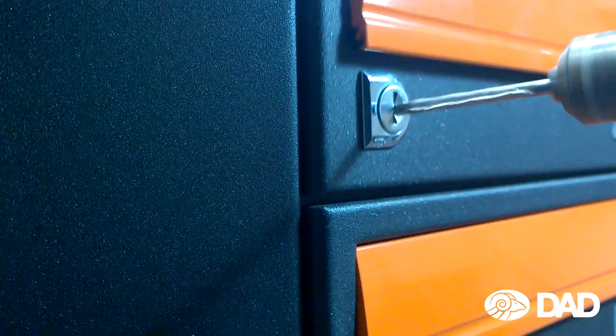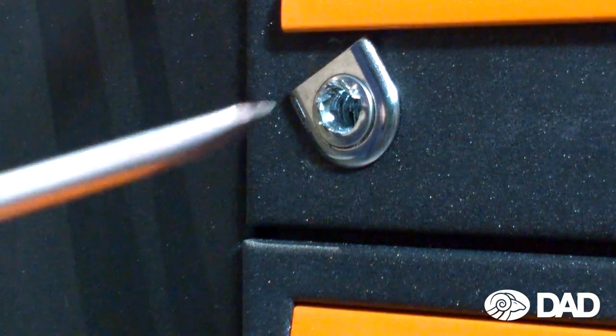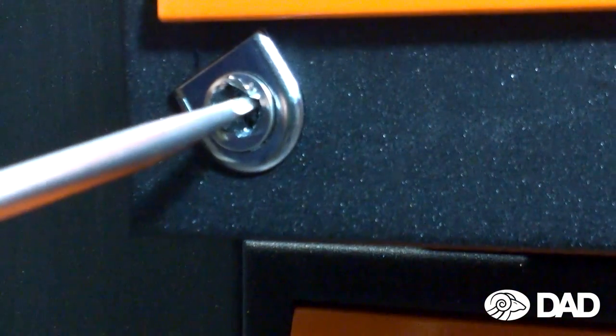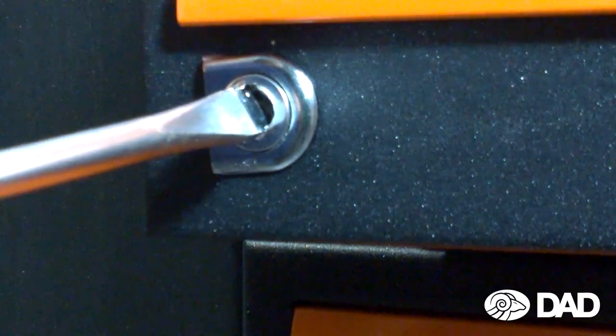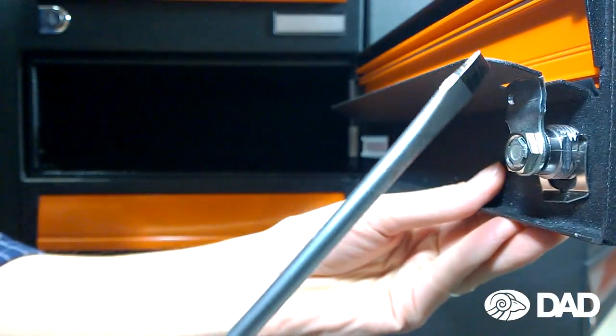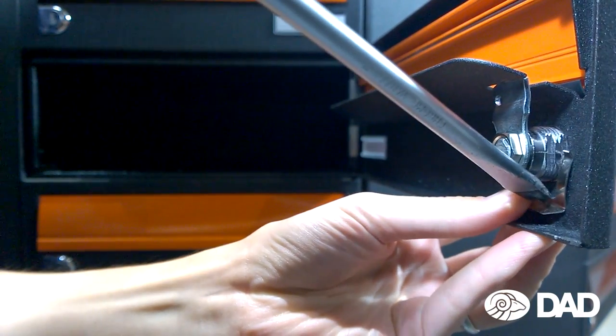Step 1: Remove the lock. To remove your old lock, you need to drill through the barrel until the lock pops out. That's the only way to unlock your mailbox without damaging it. You may need to use a screwdriver to make sure that the logo is at the bottom and the straight edge is to the left, like a capital D.